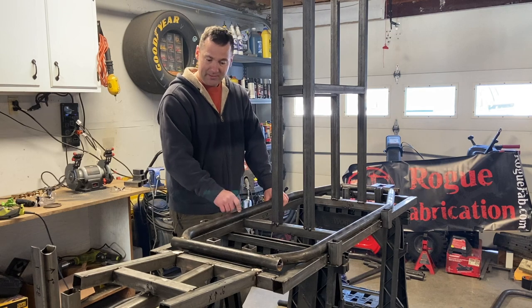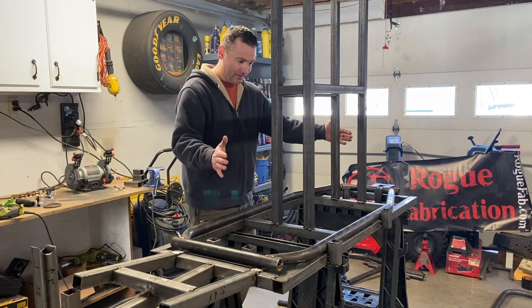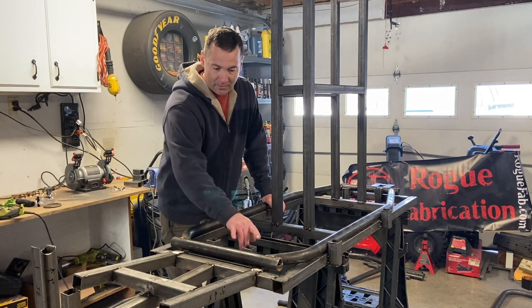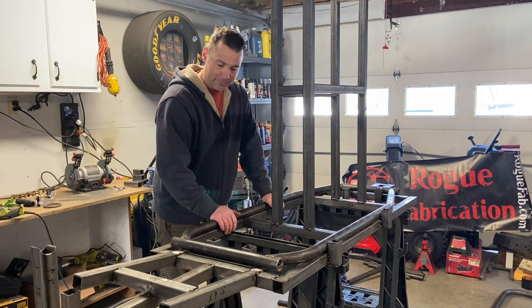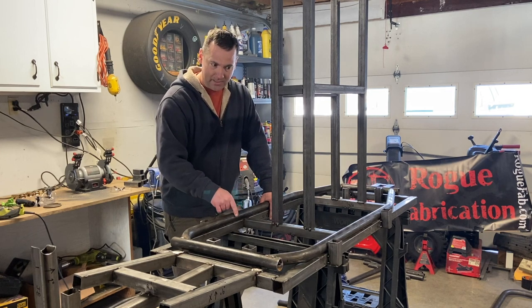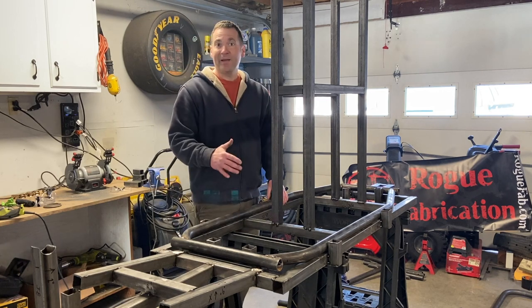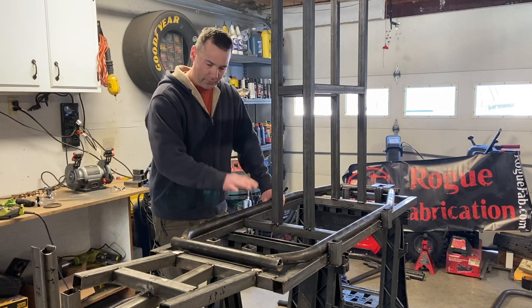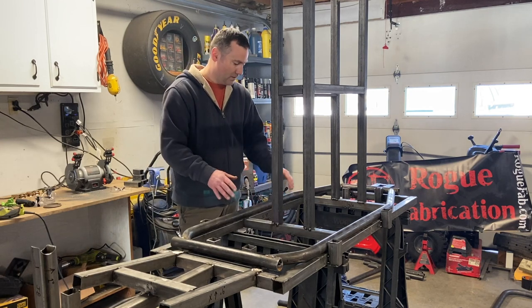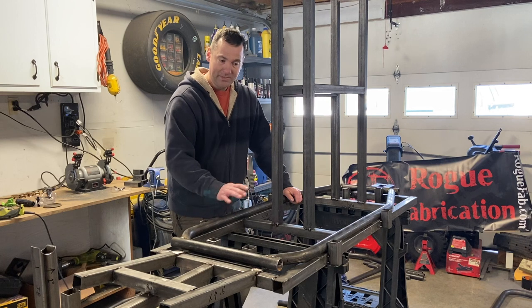When you're using a jig and you have a piece in it, the only way to make sure it's square is to flip it — that ensures the front and back aren't crooked and the side to side are perfectly in line. I ended up welding blocks onto the side instead of clamping them for that reason. I'm a methodical guy, and that's what it takes — this is not a snap-tight kit, it is a fabrication. Doing the floor first and learning how to make things square sets the tone and standard for all the rest of the pieces.